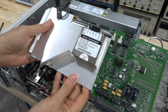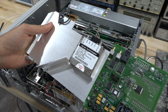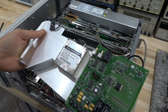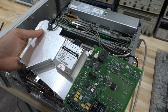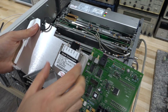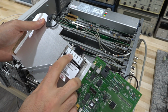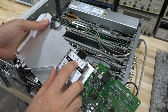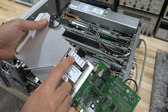There is our board. And just like I thought, Elcom Technologies makes this. It is not made by Keysight. And this is apparently part of the second LO control as well as fan control, evidently. Yeah, so anyway, should be pretty cool now. Now, this is obviously completely independent: plus 12 volt, ALM, not sure what that is. ALM is alarm. Okay, so if it's in, for example, unlocked AFC, analog frequency control, I'm not sure actually. I don't know what that is, and ground.